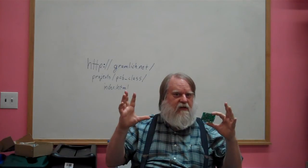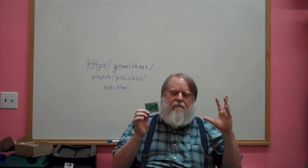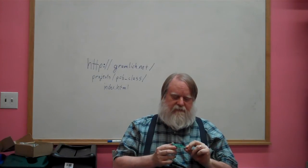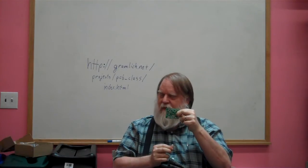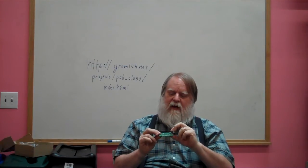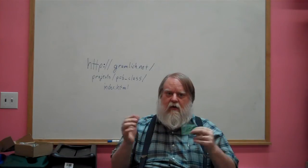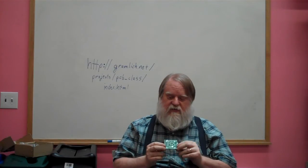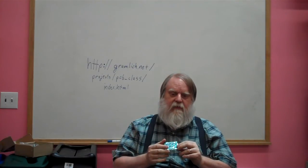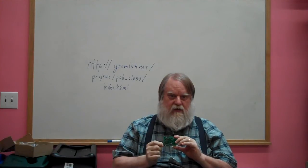And once you've done that, the next part of the process is something called footprint selection. Footprint selection is basically deciding which version of a part you're going to use in your product. So you may have a microcontroller that comes in three different packages: ball grid array, gull wing, dual inline package. You have to decide which package you're going to use, and there are lots of issues there, but ultimately you've identified a part and a package that you're going to use.